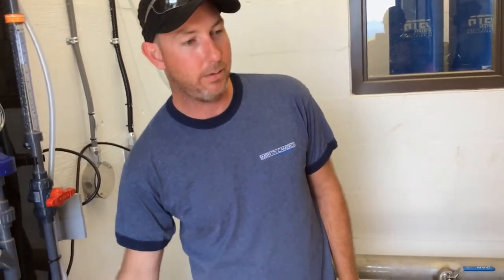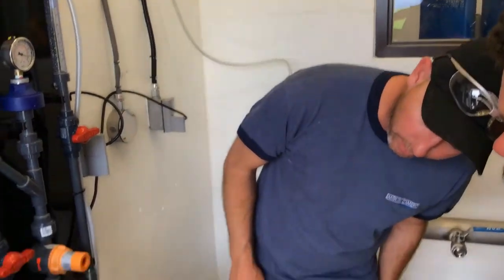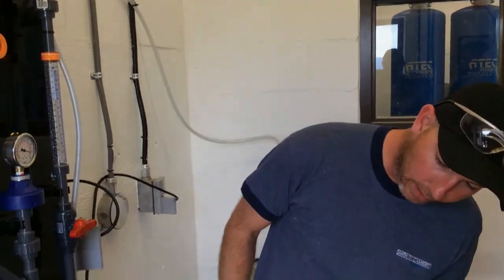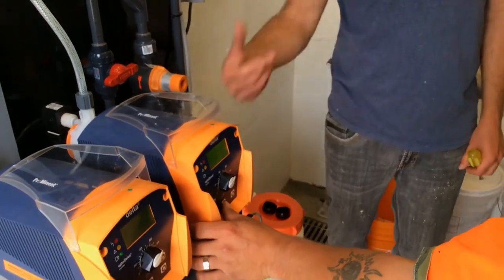Low pressure can actually sense a broken discharge line. But with low pressure on the discharge, the problem is that with bleach, it doesn't work very well with the gas. So I usually leave it as none. If you go to low, it should be none, so it's off. It works well with other chemicals that don't gas off, but it doesn't work as well with the bleach that gases off. I just find it problematic. So go up arrow once, and now we'll go to settings.